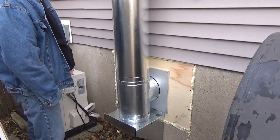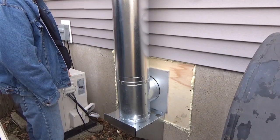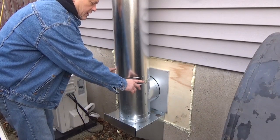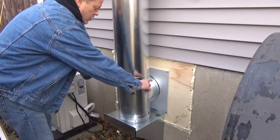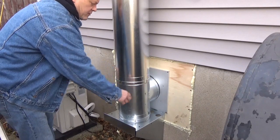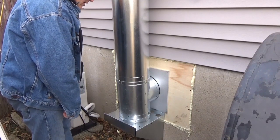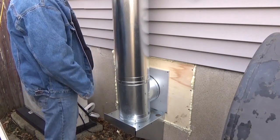I'm gonna make the rest of the chimney go up. I haven't decided whether I'm gonna cut the soffit out completely to just a square opening, or come up through the bottom with a round opening. I've got to leave two inches from a flammable or any other object, so I'd have to make a hole about 14 inches. Through the roof, I'd have to go with another hole through the roof, and then you have to finish it out with some flashing to keep the water from dripping. I'll figure that out as I get up there.